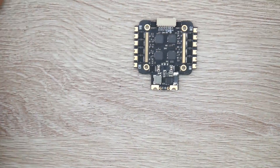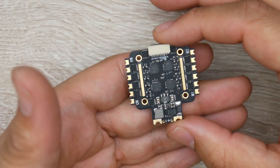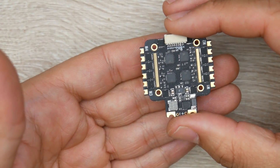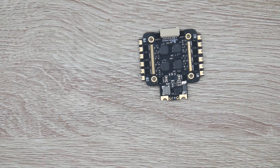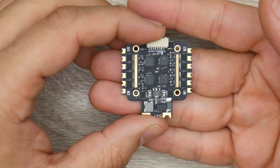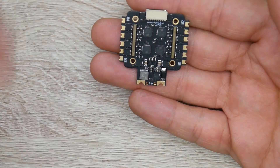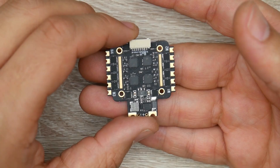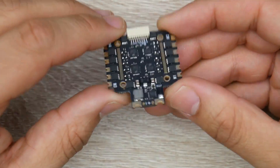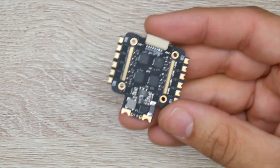I personally highly recommend you don't install this on anything above a 4-inch quadcopter. You could probably get away with it using really old 2205 Racerstar motors on a 5-inch, but if you want to go super heavy duty I wouldn't set this up on a 5-inch — stick to micros. On paper, this is by far one of the best price-to-performance ESCs for micros since it's 6S, 40 amps, with a 5-volt regulator for $37. Overall, this is a really nicely priced 4-in-1 ESC with the amount of features on board: BLHeli32, 5-volt regulator, 6S, 40 amps. In terms of longevity, I don't think it'll last that long on a 5-inch — a really bad crash might burn it. Everything's linked down below. I really hope you guys enjoyed the video — see you in the next one.